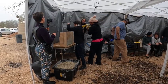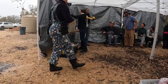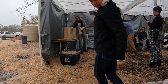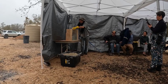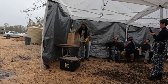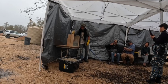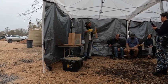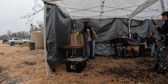One thing that tends to happen is people dump a load in and then start tamping straight away. They throw it in, they don't really lay it out properly, and then they start tamping. It just starts to get uneven, with no consistency, and then it's really hard mentally to see where you've already tamped and where you haven't.